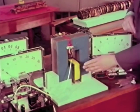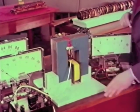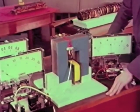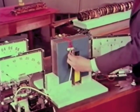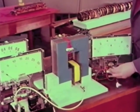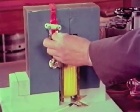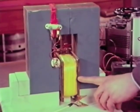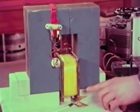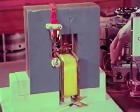When I switch a current from a battery into the primary coil there will be a momentary current in the secondary. I'm going to remove the meter and replace it across the secondary with a small lamp. If now I can change the current in this coil continuously, which I can do by feeding it with alternating current, then I can light the lamp continuously.